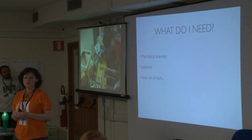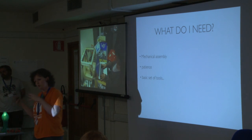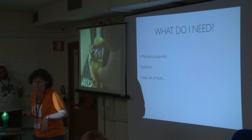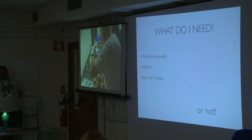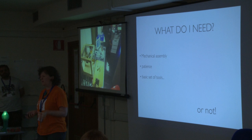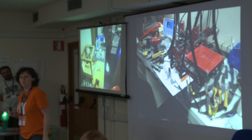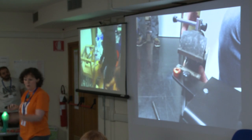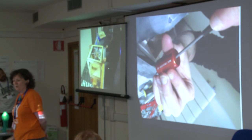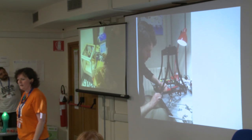Usually you just need to assemble the mechanical part. Most kit printers don't ask you to solder things or use complicated tools. But it depends from printer to printer. You need a lot of patience. And you need a basic set of tools — or maybe not just basic. The Ultimaker gives you one tool with the kit and with just that single tool you can build about 90–95% of the printer. For the CB printers, we used multiple sets of tools, a hammer, and files because the rods weren't perfectly filed. And then we used an incredible amount of patience.